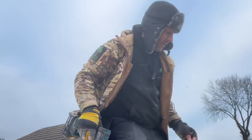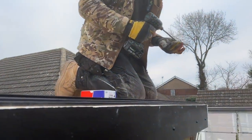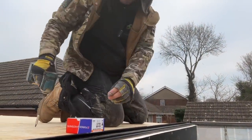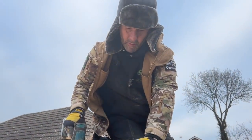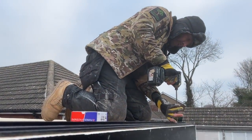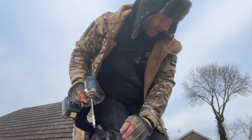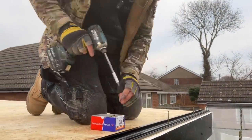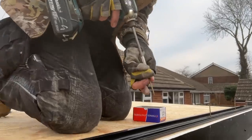We're using 60mm screws — the same as what we use for the floor. The benefit of putting this on now is you can screw this up here and you're not going to risk screwing it through the rubber. You just want to get your screws started like that, going approximately every 400mm, and work my way along.